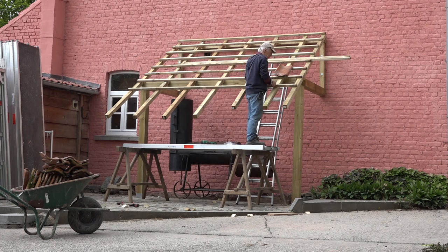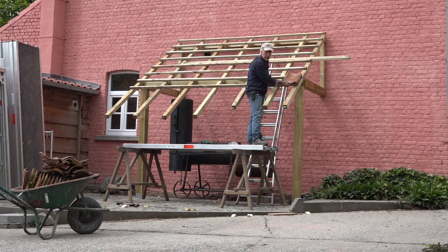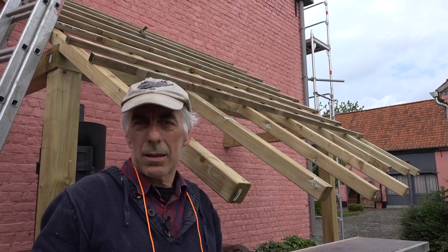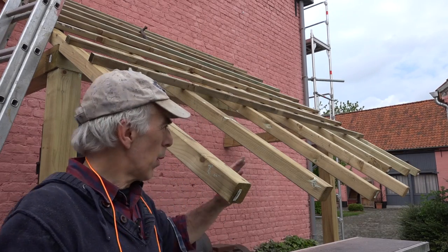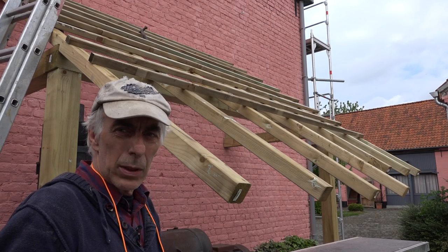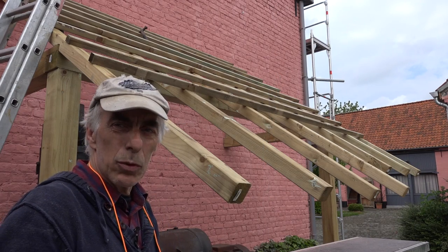You don't have to do that, but that's something I quite often do. You have to make sure that the bottom ruler is far enough underneath the tile, because otherwise when it starts dripping it's going to get wet. We've got the rulers on the rafters ready to receive the tiles. What's left are these extensions — the surplus wood of the rafters — and we'll cut them off now, but first we'll mark with a level so we have a nice smooth cut.